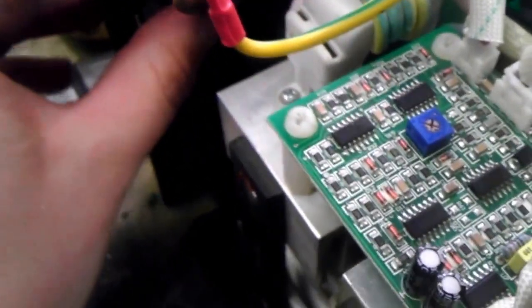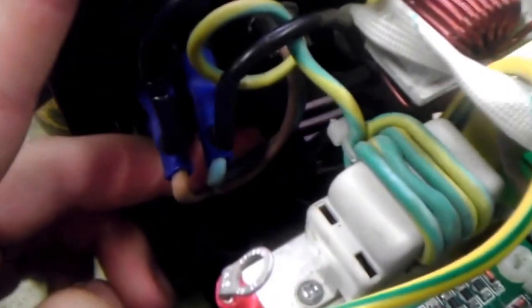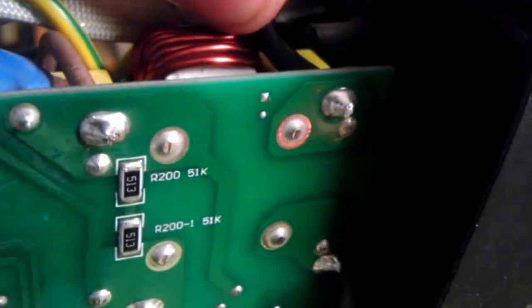So I'm guessing, hopefully, if we look at the power supply, active, it switches both neutral and active. That's surprising. That's very surprising. This might actually have an air of quality to it. Active there, so that's pathetic autofocus. Comes in, let's go through a capacitor, to a choke, a couple of resistors. Now I'm guessing, alright, here we go. High voltage out into a diode.